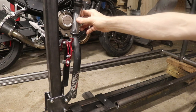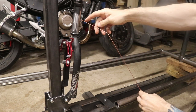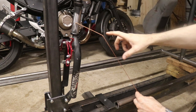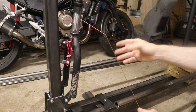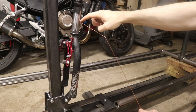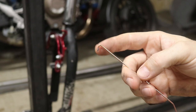I've got my head tube reinstalled and my little wire template here. Now I can measure out the distances I need to cut the pipe for. I need two pieces — one for each side — at this length, and then another piece that goes from here down to here. I'll overcut those so they're longer than needed. I'm going to start up here, cut this one at the angle needed, then do my tube notching to fit around this tube.